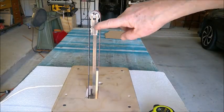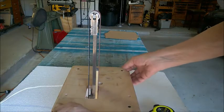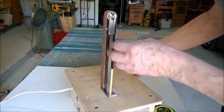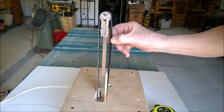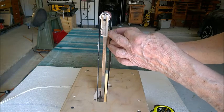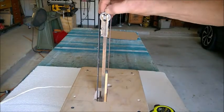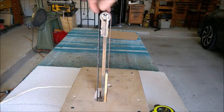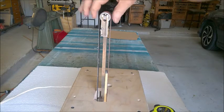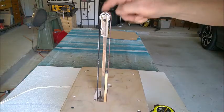On the top you can see 3/16-inch by 3/4-inch thick pieces of cold rolled steel fastened to another piece of steel connecting the two together with screws. That whole assembly clamps with the aid of a brass threaded block on the back to the column, and it can slide up and down. There are also 6-32 screws drilled through the 3/8-inch shaft that the pulley rides on, so fine tracking adjustment can be made with two Allen screws on either side.